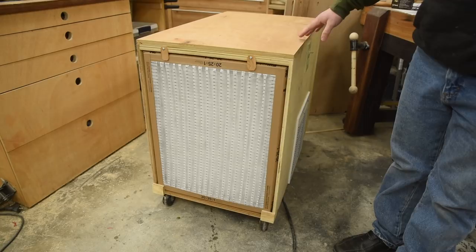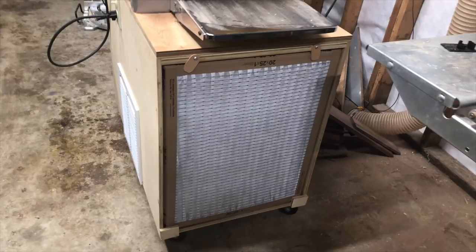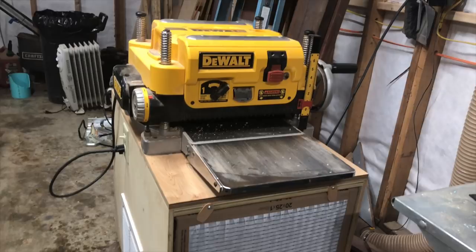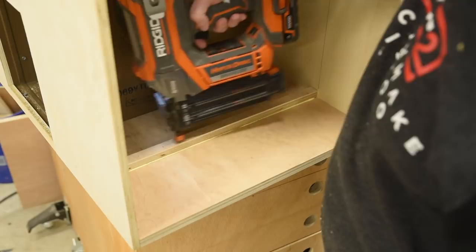The big design difference you'll notice is most air cleaners I've seen pull air in one side and out the other, but the way a blower motor works is it tries to pull air in a T-shape — air comes in two sides and then out another way perpendicular. So I set up the cart to work with the way the blower wants to pull and push air, to hopefully minimize the amount of turbulence and resistance inside the unit. One consideration that was probably hard to see is I made sure there were several inches of standoff distance between the blower itself and the first filter, just to prevent the blower from concentrating on a small part of the filter and let the air disperse more evenly.